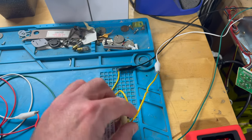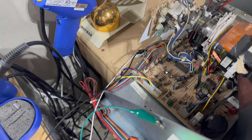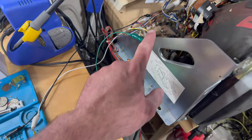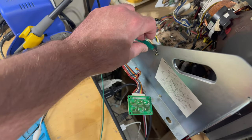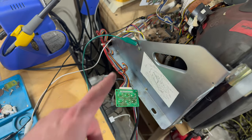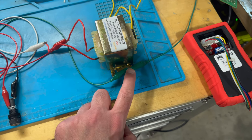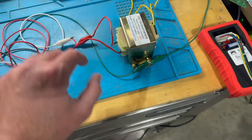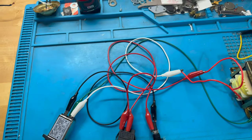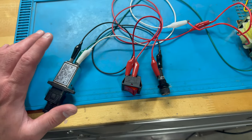And then the output lugs run to a couple of wires that I've got temporarily connected to the input power connector on the monitor. And I've also got a ground wire going from the frame of the monitor. This is one of the points intended for ground, and it comes over here to the isolation transformer, and I've got temporarily just a little bolt right here holding it all together, and then another alligator clip comes back to the grounding bit. And I got a little bug here despite the citronella candle, because I've got the garage doors open because it's beautiful, to the other ground here, and so it's all grounded.